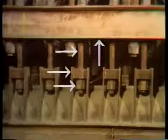Corrosion of the boiler casing can be caused by moisture. It's a problem that can show up anywhere. Indications of corrosion are discoloration, roughness, and holes in the casing metal. Unpainted steel is particularly susceptible to corrosion attack.